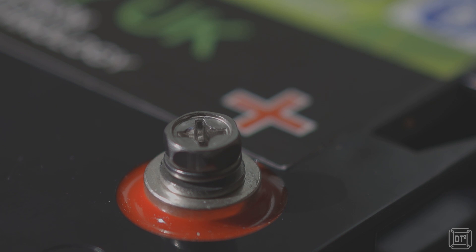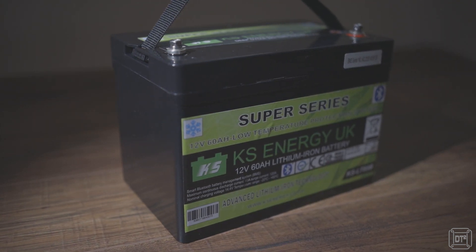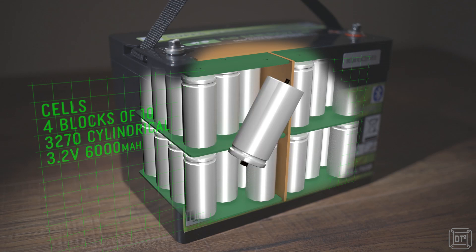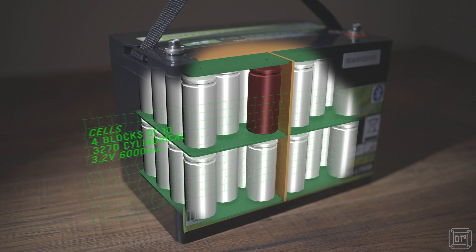The terminals are M6 bolts which can be tightened with either a spanner or crosshead screwdriver. The holes are blind but deeper than the length of the bolt provided, so it should always be possible to get a solid connection without risking overtightening. The positive terminal is clearly marked in bright red with additional notation on the top label. The battery is a sealed unit and I'm not going to break open a brand new battery, but KS Energy have shown the internals of its bigger brother and confirmed they are similar — I'll add a link to their video in the description. The LT60B uses cylindrical cells rather than rectangular prismatic cells, meaning that if one cell fails the battery will still function, whereas failure of just one of four prismatic cells would render the battery useless.